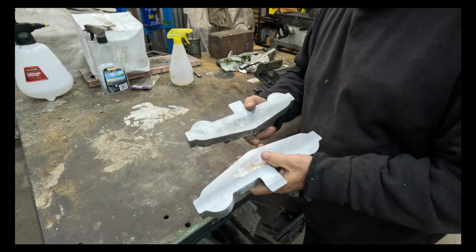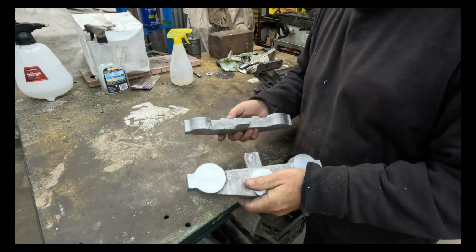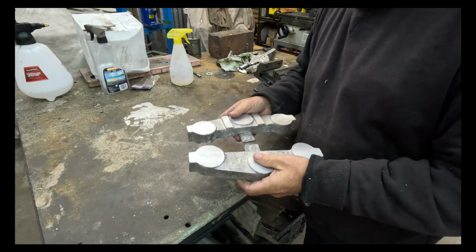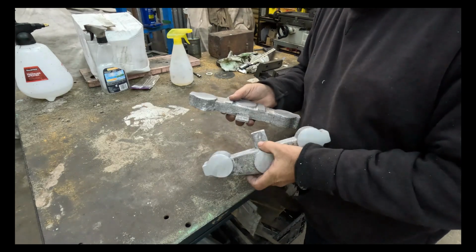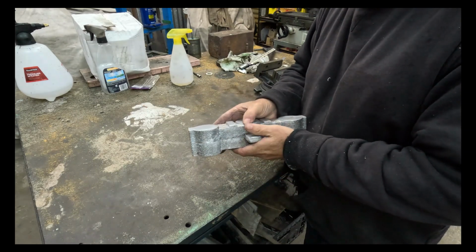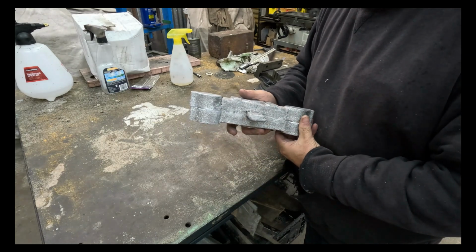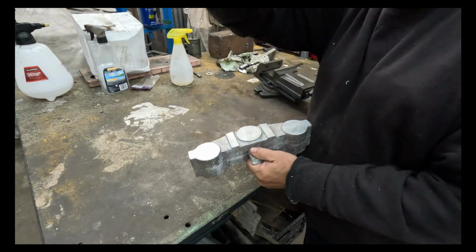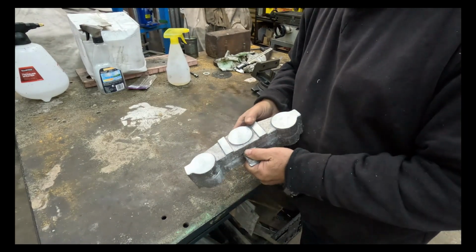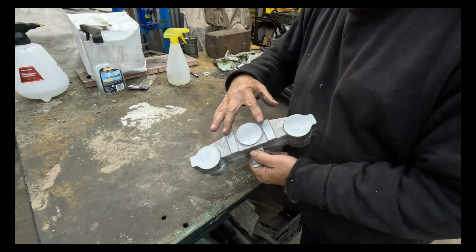Okay, as you can see, I've machined down the undersides. Didn't quite clear up that little depression. I reckon another millimetre and I would have got it. And we've machined these top surfaces here on both. Now, this little pouring gate here not only acts as a clamp surface when I bolt it down to the milling machine, I'm actually going to drill and tap a hole through there and put a bolt through there to keep these parallel and in alignment. So this is our top clamp.